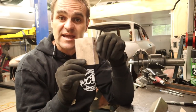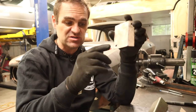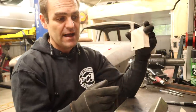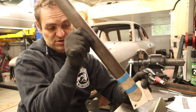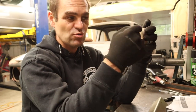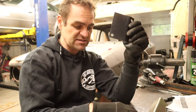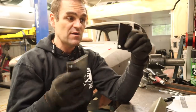I made up my little cardboard template that fits into that panel — it's got a little fold in it to wrap around the corner. The main rectangle in that spot wouldn't fit entirely at 60 square centimetres, and when I cut my tube on an angle you wouldn't be able to get to both of the bolts — it needs at least two M8 bolts. Wrapping it over the side makes sense. This is about 70 square centimetres, just bigger than what I need. I folded up my pieces, cut them out with the plasma, and now I'm going to put some captive nuts on it and start making the mounting plates for the cage itself.